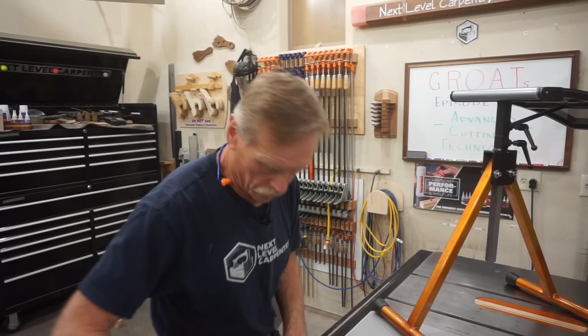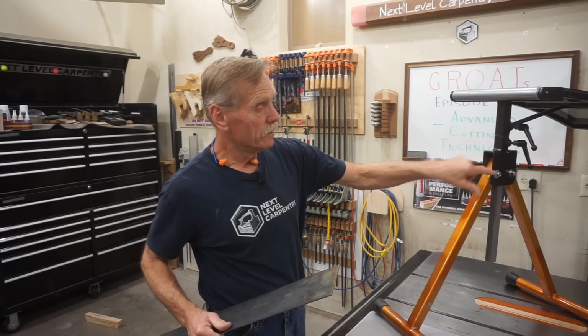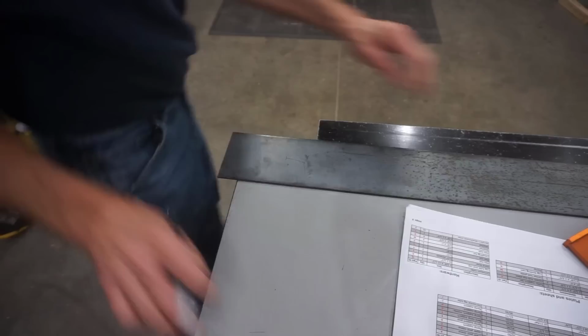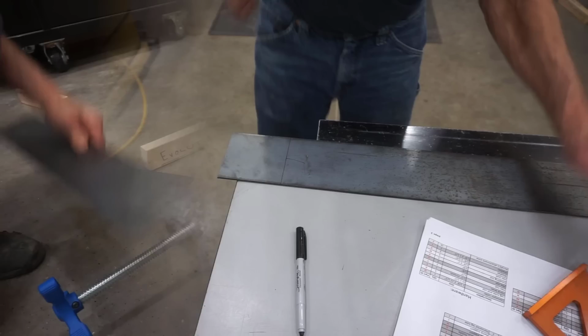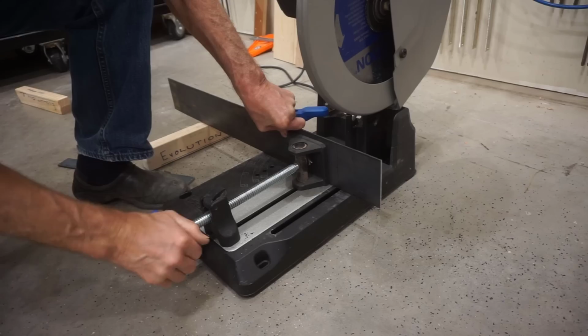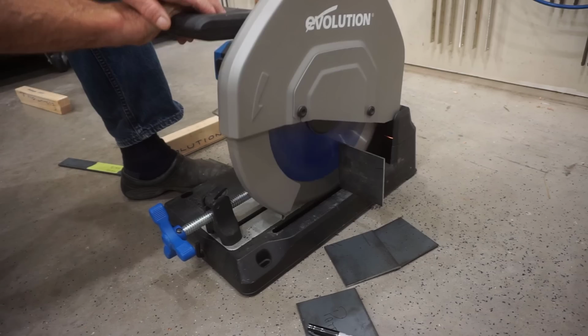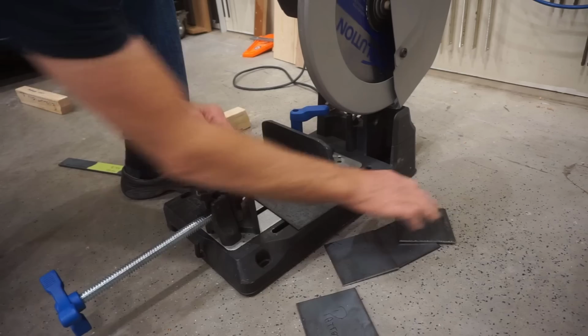4 inch stock and cut 4 plates for this pivot housing in much the same manner as the pieces I just cut. I start by double checking that the end of this 4 inch wide piece is square, and then use the rule and square to mark off the 4 inch length for the pivot housing plates. And then it's back to the saw for the cutting procedure, which is pretty much like what you've already seen, but I wanted to show you this because it's kind of unusual to be cutting this wide, thin stock with a metal cutting chop saw if you've never done it before. Again, I make sure the blade is up to full RPM before cautiously but steadily lowering the spinning blade into and through the workpiece.